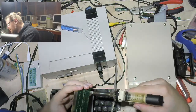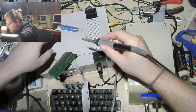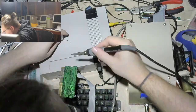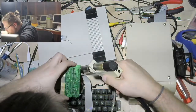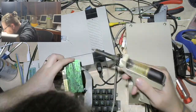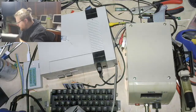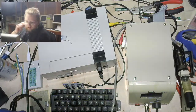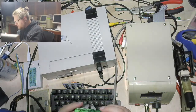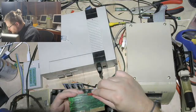That one really does not want to let go of its solder for some strange reason. So, if it's solder that it wants, let's give it solder. Yeah, that's it. Now, I seriously doubt that got the whole chip all the way out, but the holes look goodish. Probably just have some tiny little solder ridges on the edges of the hole, and when I find my tweezers, which are right here, maybe we can break those. Yeah, that does seem to be the case.